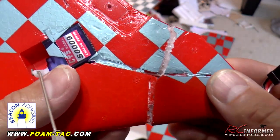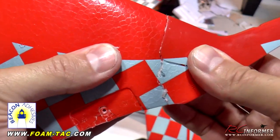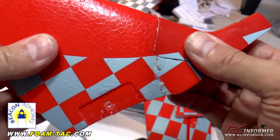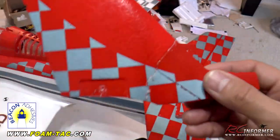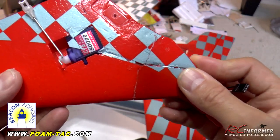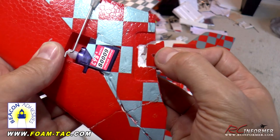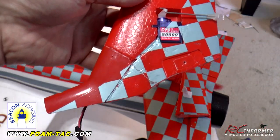After sitting for a minute or two, do the final tack installation — just push the whole thing together and it'll be well bonded. Let it fully dry, then any excess can just be peeled away — it comes off easier after the fact than while it's still super tacky. You'll end up with a really superior bond that looks almost like new, and it stays rubbery — it doesn't get brittle like epoxies and CAs do. Do the same thing again for the second section: add glue, take it apart, put it together, let it tack up, then make your final installation and let it dry. You'll have a nice, tough repair.